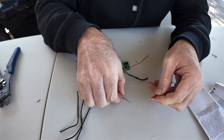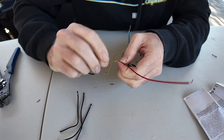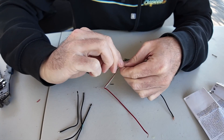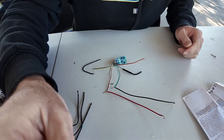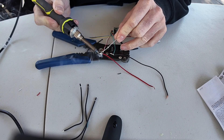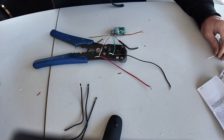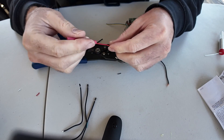Here's some wire I prepared earlier — a bit thicker gauge at least so I can put it into some crimp terminals. I'm going to twist in the wires and then add some solder and some heat shrink to those joins to keep them together.